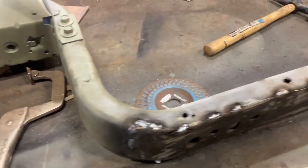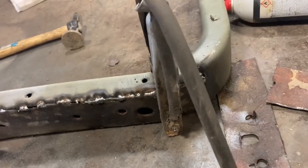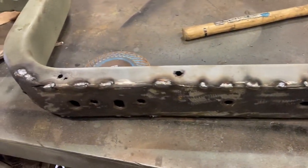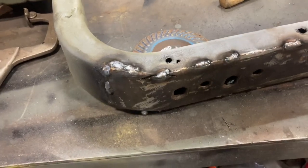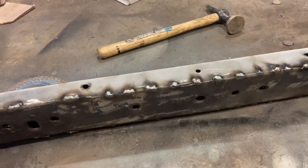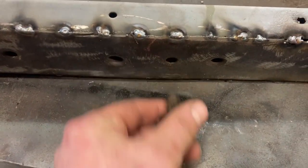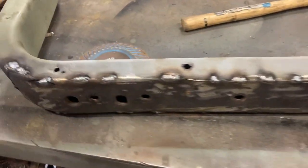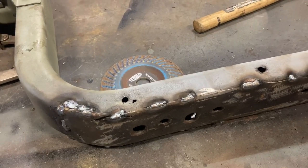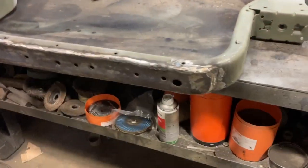Here's where I'm at. Just stitching it together, so I'm just taking my time. It's not gonna warp much because I put it on that curve there, so I can get away with a little bit more heat going a little bit quicker. I did kind of a lap weld too, so that's gonna help with warpage, and when I sand that down and grind all the welds, it'll kind of blend in with the curve and you won't really notice that it's been repaired. It's all primed and painted on the inside, then I'm gonna put some rust proofing in there as well. I know it sounds like overkill, but if I'm gonna fix it, I might as well rust proof it up, and it should be good for many years to come.